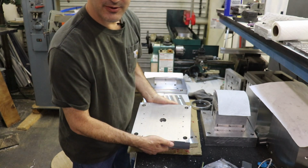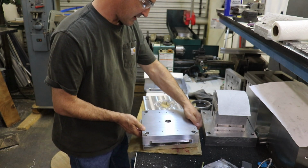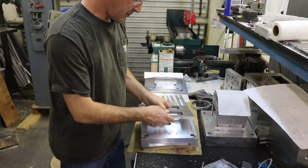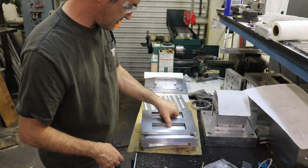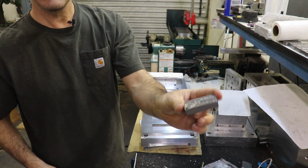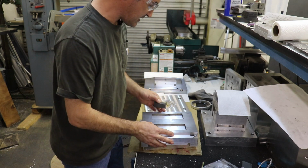that was purchased from AQ Molds, if anyone was curious. And I went ahead and machined all of the mounting holes and the dowel pin reference holes to register our EDM cut steel reference plate. This is A2 steel, which is going to mount like this. And then all of these machined A2 inserts that we're going to apply are going to fit over our threaded M3 holes in the aluminum plate.